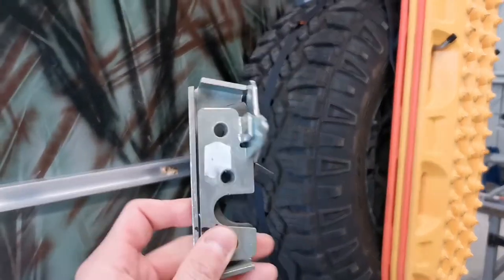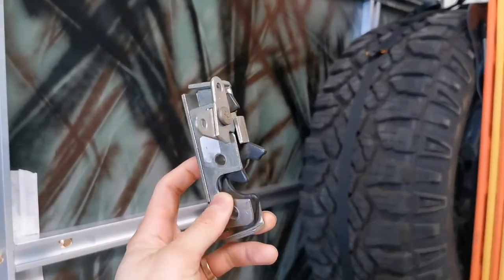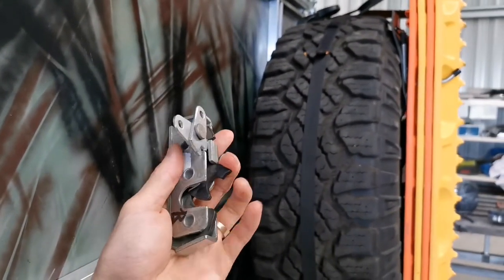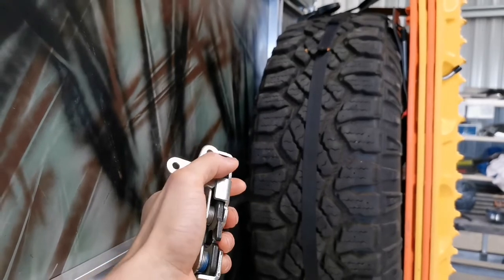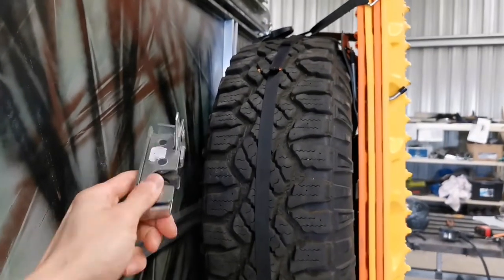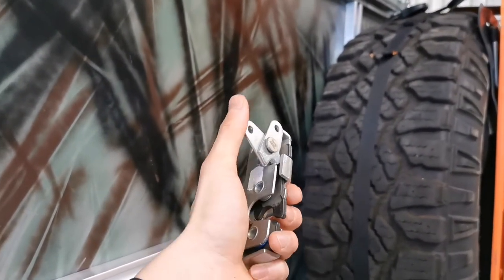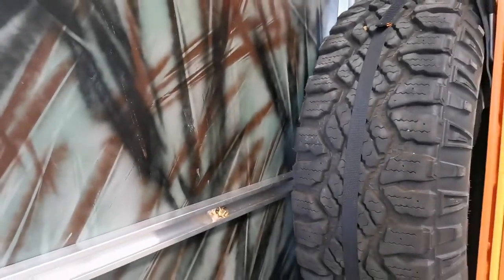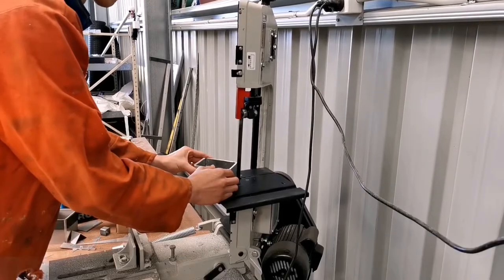Right, the second part is about this, I think it's called rotary latch, or bust latch. So basically what the mechanism is, you slam a bar onto here and it locks it in. And then to release it, you either pull these two levers or you press that mechanism here. So in this case, because it stays behind the tire, I have to control this by cable. It's just like the brake sort of system. And you pull this out and you pull this down, and that catch releases the tire carrier. So I guess at this stage, we'll work through these two things first, and then I'll see what happens after that.